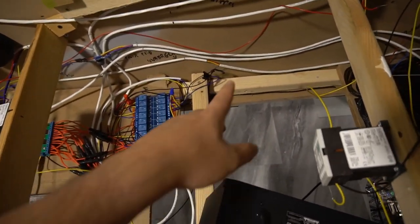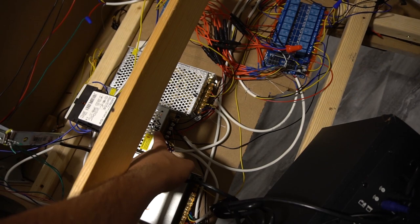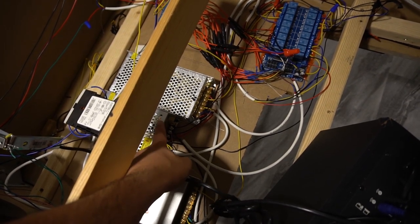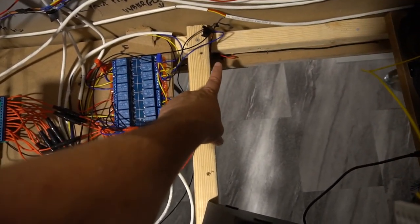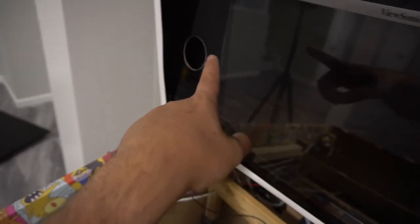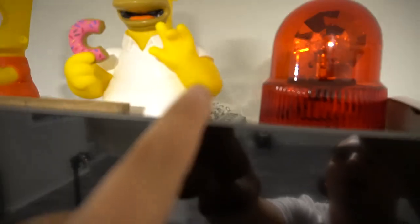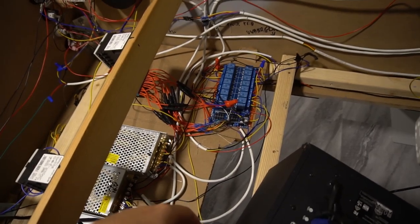Next up, we got the strobes and the RGB flashers. How do we wire them? Same thing. Remember, our strobes are 12 volts. We have a negative 12 volt wire coming from the power supply to the automotive strobe. And then it is daisy chained, negative to negative to negative. It even goes up to here. Negative from the power supply, you daisy chain all the negatives.